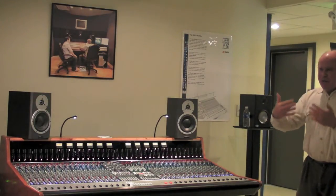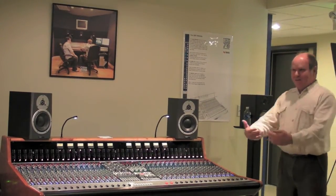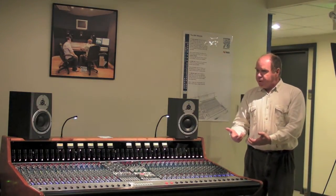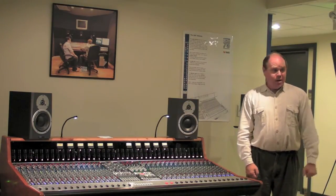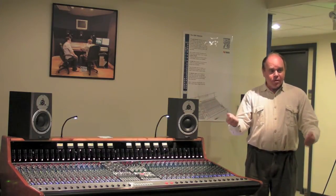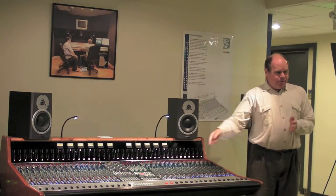There's a little button on each channel called 'retro' that routes the channel onto the voltage summing mix buses, giving the old school Neve sound. You can route to the modern mix bus for basically sonic transparency. There's also a global button to route all of them one way or the other, or you can do some and some individually. Because when you solo a channel you want to hear it with the same sonic character as what's going on the mix bus, we've replicated the AFL buses — four stereo mix buses in total: left-right modern, left-right retro, and corresponding AFL buses. So when you solo a channel, the console routes to the matching AFL bus and you get the same sonic character on your solos.